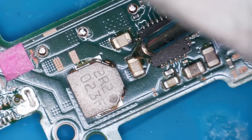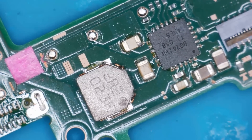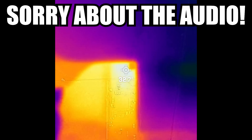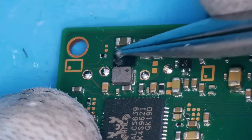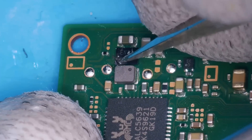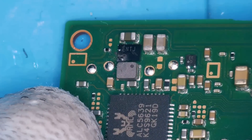I'm injecting one volt — and we get a one amp draw straight off the bat. I need to grab my FLIR cam and it's going to tell us where this short is. I've injected again, and there's a bit of a heat spot up here. When I take it off you can see the temperature falls right back down. I think we've found our culprit — I think it's this component here, which is on the back of where we were just getting that heat signature. This component here looks like it's just falling apart — it had a hole in it, and this is what was getting hot.